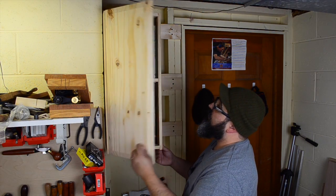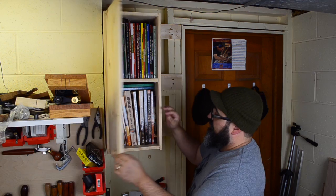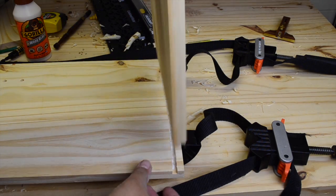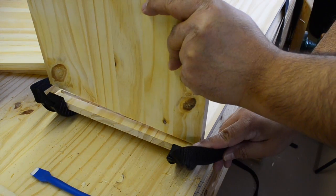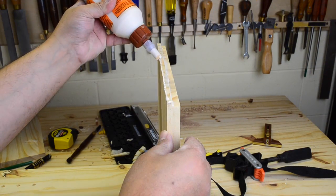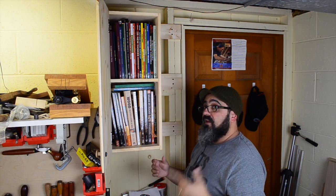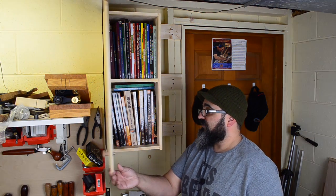At this point, we're almost done with the construction of the small pine cabinet. We just need to glue it together and attach the door. The beauty of this blind rabbet joint is that it's self-squaring. We simply apply some glue into the grooves, making sure we get that glue on the shoulders of the groove to ensure a nice strong glue joint. Once we have that taken care of at one end, we'll do it at the other, put in our top and bottom, get those in position, apply glue on the tongues themselves and a little bit in the groove of the other side, then bring it all together and apply some clamps. I like to use the band clamps, which really helps to make sure that everything stays nice and square. Then we'll set the box aside to dry and come back later to start finishing assembly.